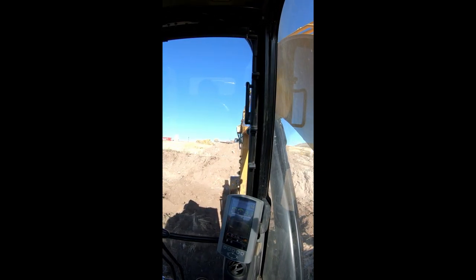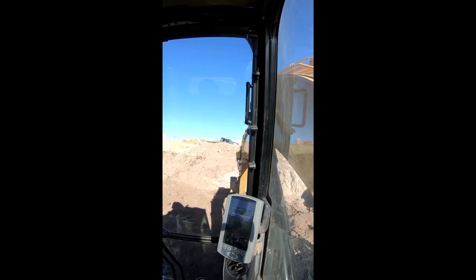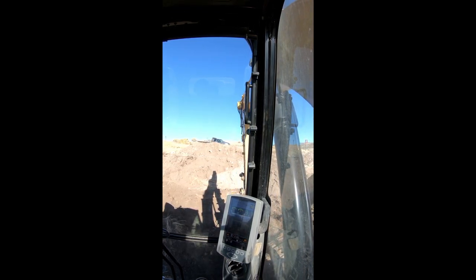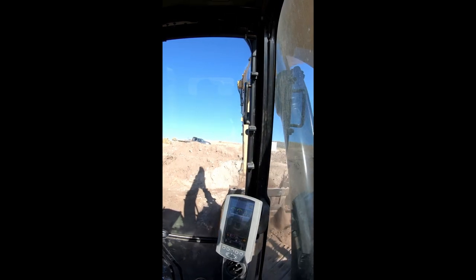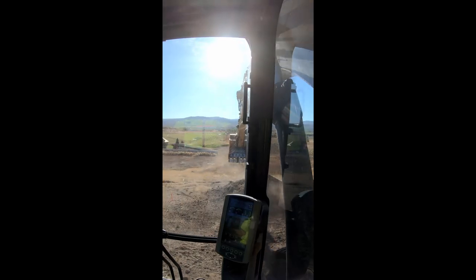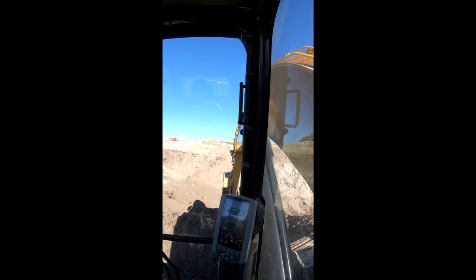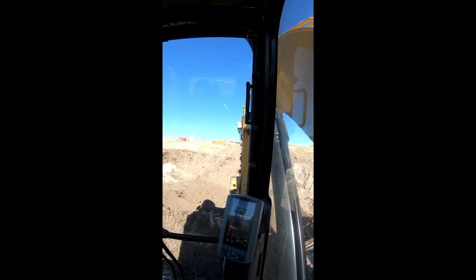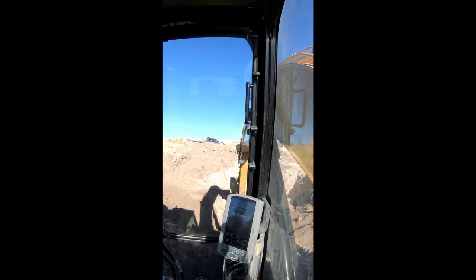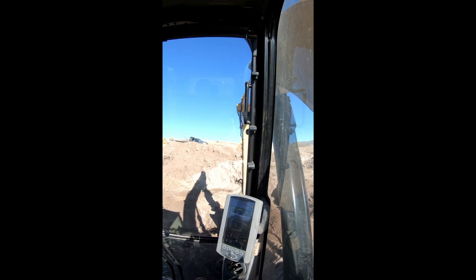And then come in with the skid steer or something, fine tune it. If you get into something relatively hard, sometimes that last 2 to 3 tenths is difficult to get down to grade with auto, so we usually switch it to manual and just do it manually, and put it back on auto and check it. I don't know how good you can see that through the screen. Probably not very good, but it'll put it right there within an inch plus or minus, I would say.